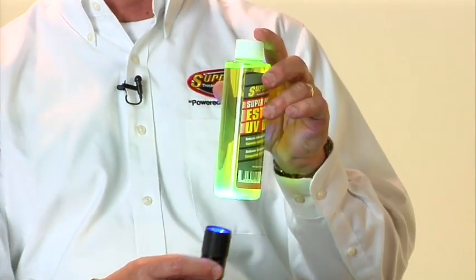When you put a lubricant with UV dye in the system, you would typically only use it when you're repairing the system and putting a full charge on it. If you've got three ounces of plain lubricant in the system and you're adding dyed lubricant, it's going to fluoresce but won't give that full dye charge. So you would use a concentrated UV dye in that situation.